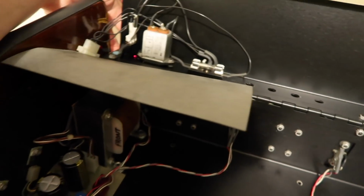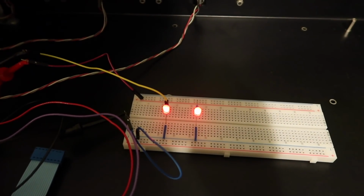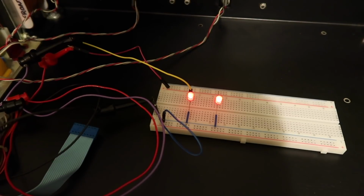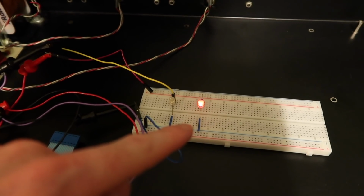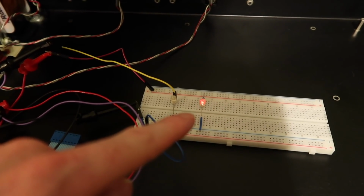So if I turn the switch off, okay, 1, 2, 3, and off. We're off now. Our power up circuit should now detect that we're off. Yep, and it's gone. And see how the 5 volts is still on? And that'll slowly fade out now. See how long that's taking to go away?